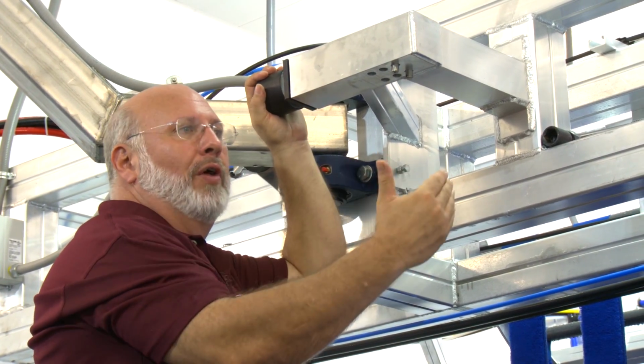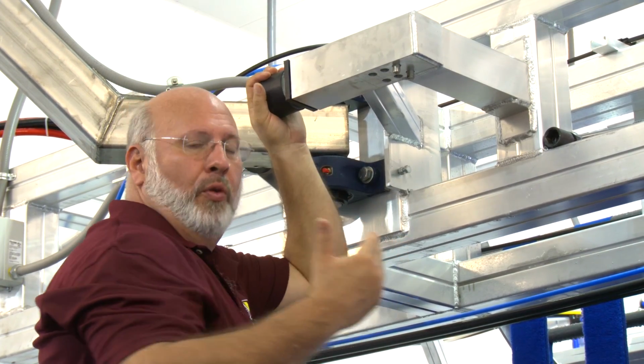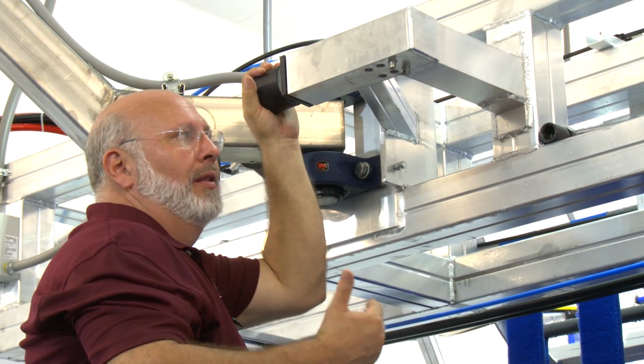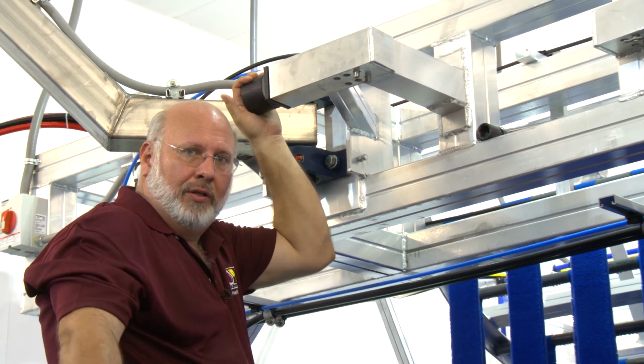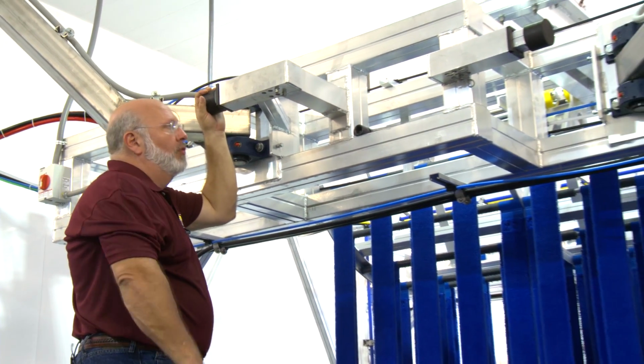Again, if you want to be more aggressive, I would recommend only moving 1. More likely you want to move the one on the passenger side because the vehicles are all different widths, and that'll help you get a little bit more impingement. The driver's side, because of the conveyor rail, is always reaching the same spot. It's much easier to move the passenger side, and the long arm is more friendly.